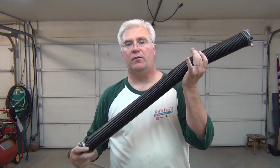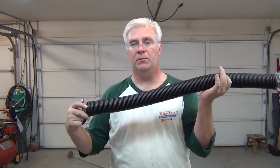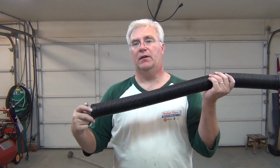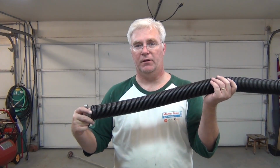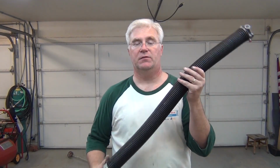Okay, I'm going from a one spring system to a two spring system. Now what it means is when I went to Wayne-Dalton, I had them cut me two springs. They're a little smaller, their stock is different, but they do it so that you have a two spring system and the loading equation stays the same. That's good because then you don't have one single spring failure option, which I like, and get more life cycles out of the stock material that they used.